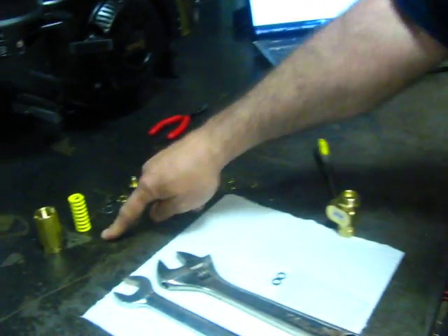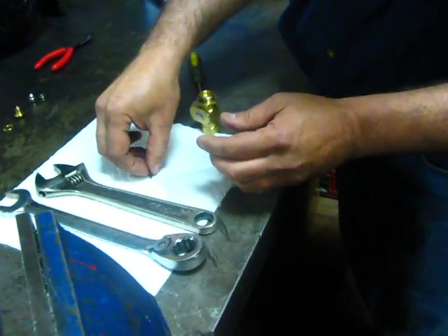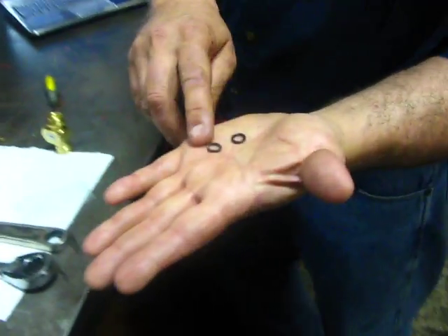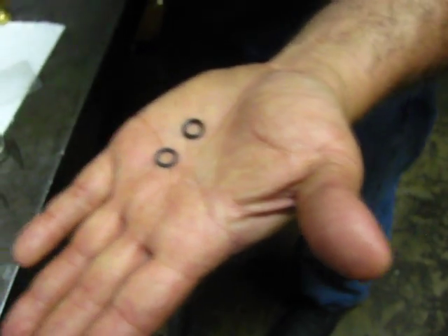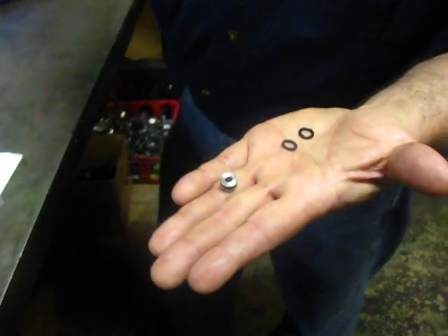Now we have about seven parts. In order to replace these, you get a kit that comes with two sets of seals. The seals on the disc which goes at the bottom normally don't go bad. However, if you need to replace them, you can go to any auto parts or hardware store and ask for a 7mm ID, 11mm OD O-ring. That should work fine. However, if you cannot find it, you may get away with a 6mm ID, 10mm OD, which gives you a 2mm wall thickness O-ring.